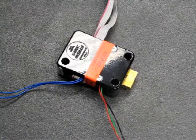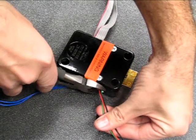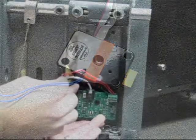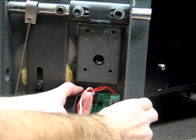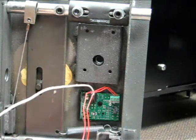In preparing to install the lock body, we can clip off the black, green and red wires as bolt position indication is not going to be tracked in this installation. Do not cut the blue secure loop wire unless a door switch is to be installed. The duress module is attached to the door using an appropriately sized drilled and tapped hole. Remove the cover and temporarily position the module on the mounting surface using the double sided tape on the back of the module.